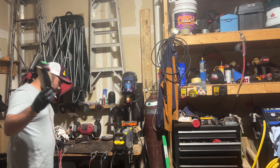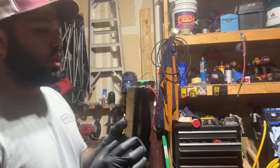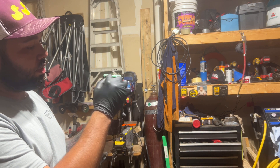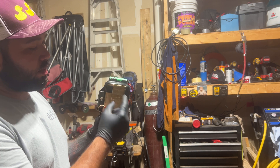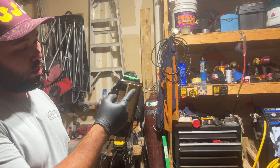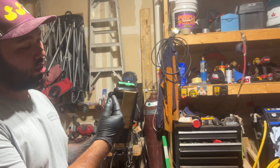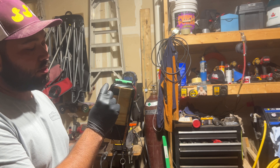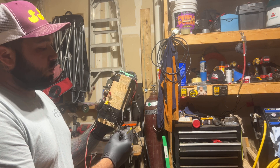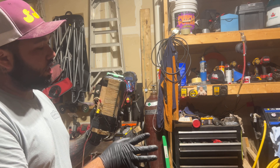So here's how I have this wired. You've got your power — the battery — and in between the power going out from the battery I have a little switch underneath here. That switch, when I press it in, powers the generator. You splice your positive wire coming out of the battery and put a switch in line going directly to the high voltage generator. You don't need a kill switch — I did that just because it's safer to handle. Put the kill switch before the main switch if you're going to include one.